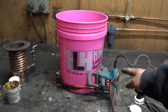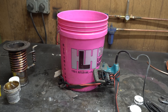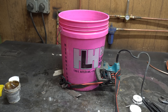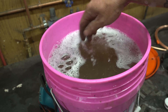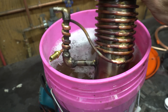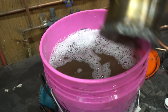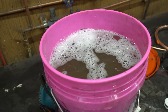Now I've got to clean the flux off of all these parts somehow. Be real nice to have an ultrasonic cleaner. So I've ratchet-strapped a vibratory sander to the side of a bucket. I threw some dish soap in there to help it along a little bit, but look at that — that is some dirty water. I think this actually did something. There's still going to be some hand work to do, but I think that must have gotten most of the flux off.